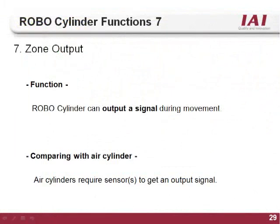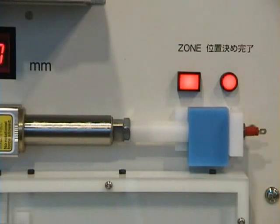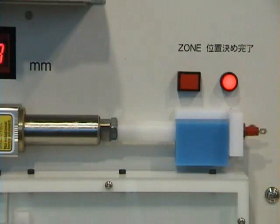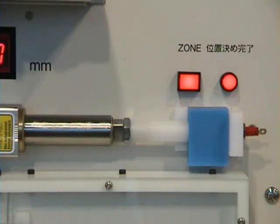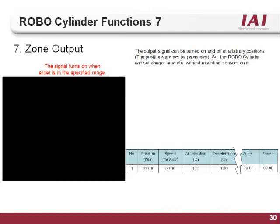The P zone output will only turn on when commanded to the position it is taught to. The P zone feature works great in conjunction with the push move — since the PEND output comes on when the force is met, a P zone can be used to indicate that the force was met at the right location. In this video demo, the actuator rapid advances and then presses into the blue block. When the press force is met, the position complete light illuminates. A P zone has also been set; when the actuator is within the set zone, the zone light turns on. Both the zone output and position complete output must be seen for a good part — if only one appears, it indicates the part is either too small or too big.